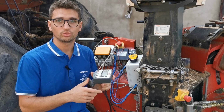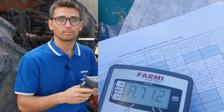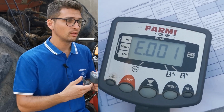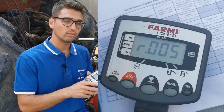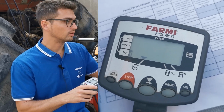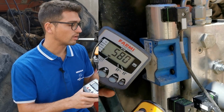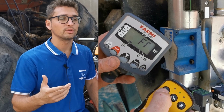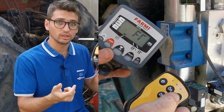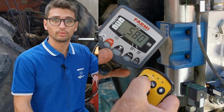We think that it was a software problem in the computer, so we tried to reprogram it by following the manual, but nothing was working correctly. In the sense that we were trying to command the normal direction, like forward and backward direction for the crane, but it was moving always backward, or sometimes it was moving conditionally forward for a few seconds. So the machine was not usable anymore.